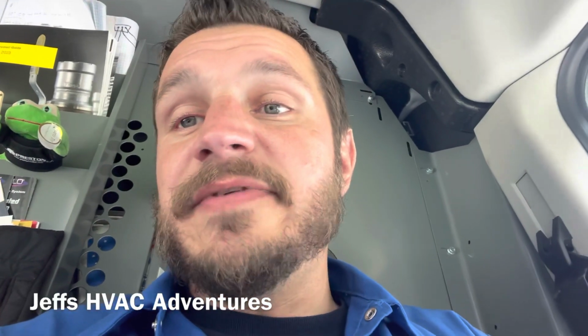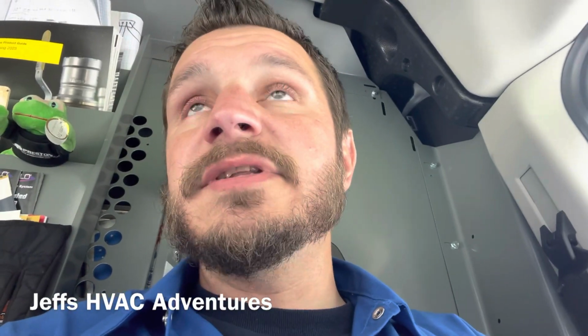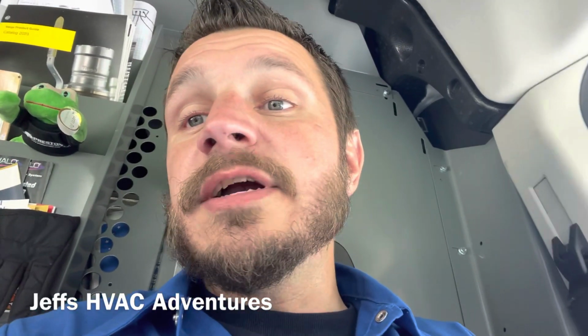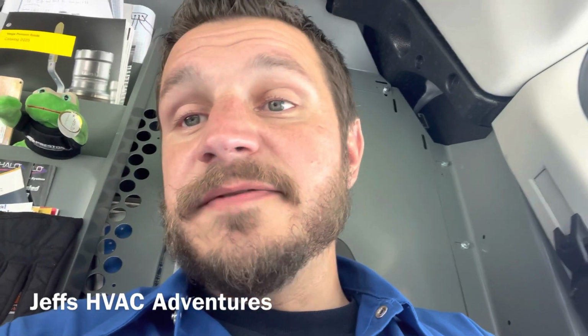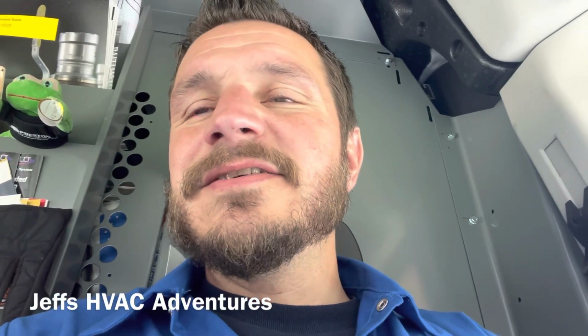Of course, they should have at least let them know they didn't have filters in them, but the maintenance guy probably should have checked the filters in the units, at least after 2 or 3 months, to see if they were dirty. So, I don't know. But the units ran for a whole year with no filters. And then they've been running, I guess, for another year or so with the filters, but the damage was done at that point. So there's probably about 40 units out here that this is going to have to happen to this summer. So look forward to that.